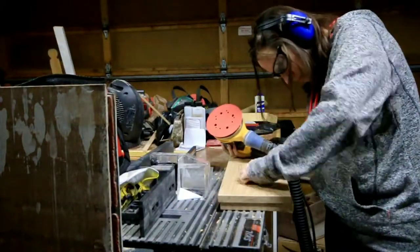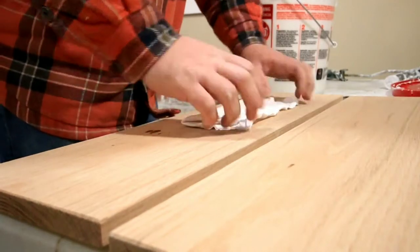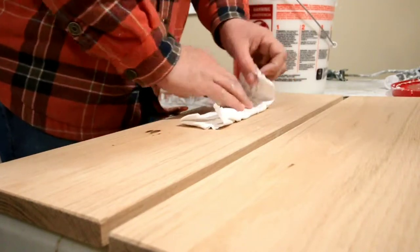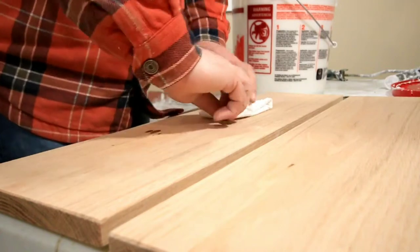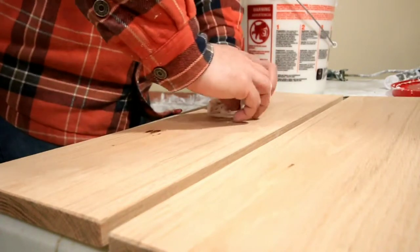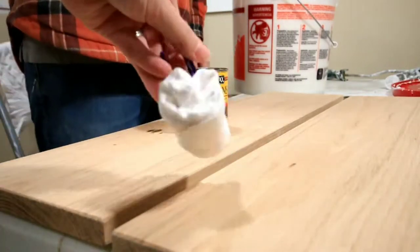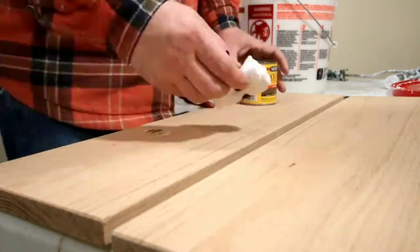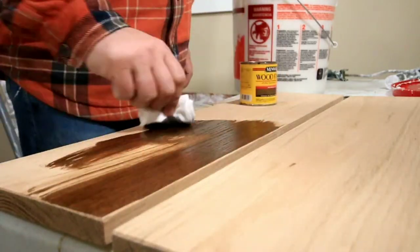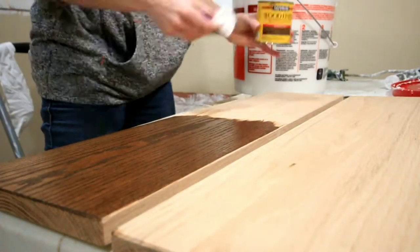Next you just give everything a really light sanding and remove any stickers on the wood. Every time I try to stain wood I end up with it all over my hands, but Logan's always really clean. So I had him show us how he folds the staining rag and puts a little clip at the top — it makes a little handle so you can stay nice and clean. Pretty genius! Then you just wipe on the stain; we used dark walnut for this.